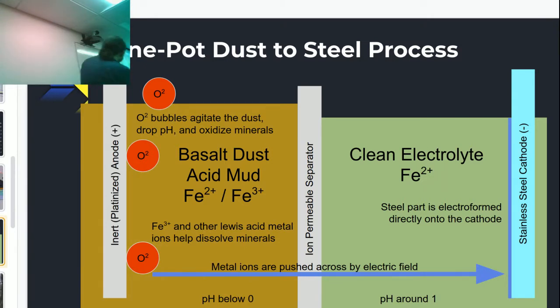Here's the overall process — the one-pot process. I literally dump the basalt dust in on this side, and this is a horrible mess of angry, oxidizing iron. I've got oxygen bubbling through here — the oxygen bubbles are great because they actually mix the thing up automatically. The pH ideally is below zero — as many hydrogens as you can fit in there — that's a key type of thing. Your anode has to survive this; it's basically sitting there in the midst of all this corrosive stuff and it has to not dissolve. So typically it's platinum on titanium — it literally does nothing except let electrons get sucked out of the solution, and that neutralizes the oxygen.